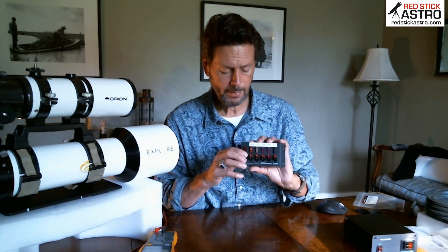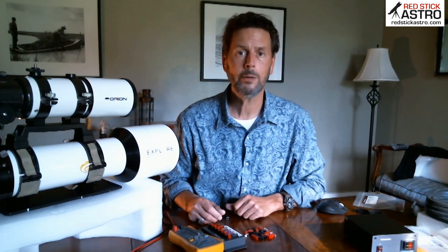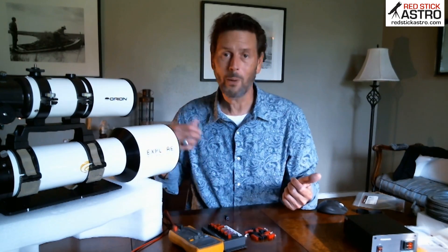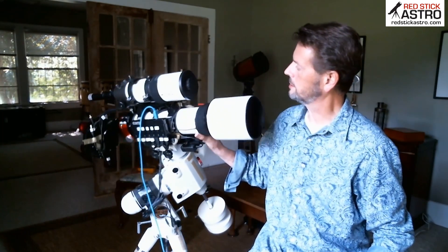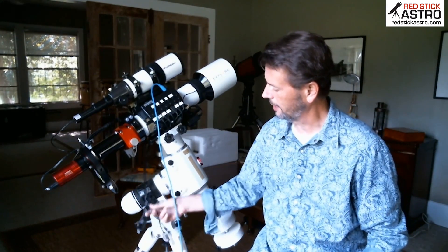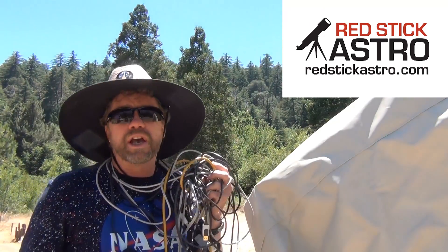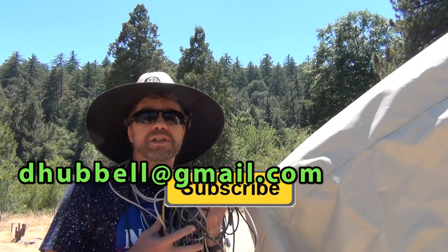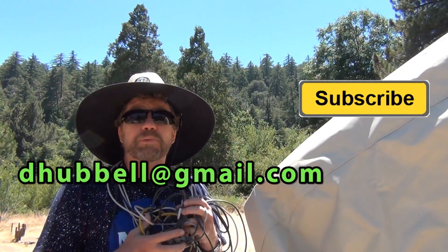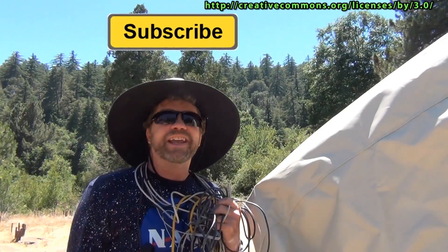When you're finished and you apply power, take your meter again and check each output to make sure they're 12 volts DC. Put it all together and power it up — when you're done you should have just two things: a wire going to your computer and a wire going to your power supply. There you have it, it's all back together, balanced, and ready to go out and image again — I've got a power wire and a computer wire. Be sure to check out Sean's website at redstickastro.com, and if you have an astrophotography tip or trick you'd like to share, contact me at dhubble@gmail.com. Thanks for watching and I hope to see you soon.